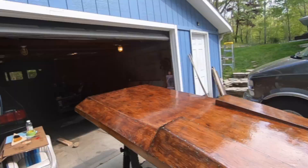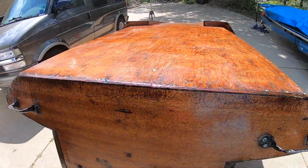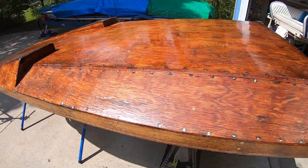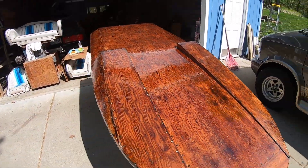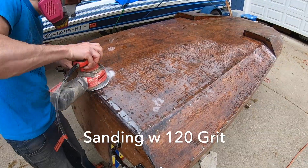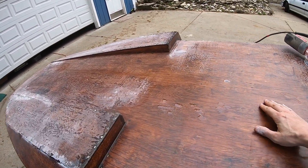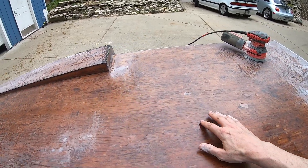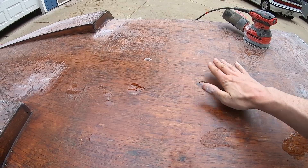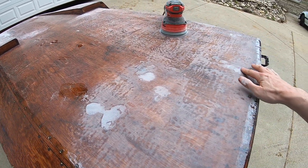This is four coats of epoxy. What I'm trying to do while I'm working here is scuff up the entire surface to get it even, and then in areas where I just recently added a little more epoxy, I'm tilting the sander to try to feather it into the rest of the surface. You can see there's no actual real edge on some of these repairs — they're pretty smooth.